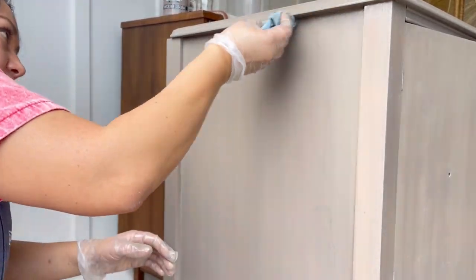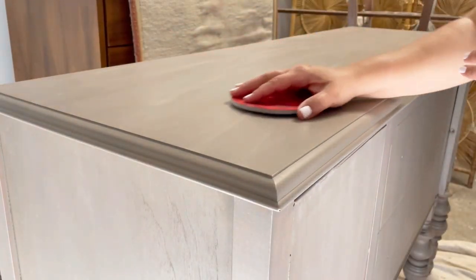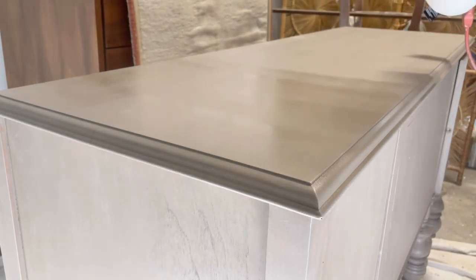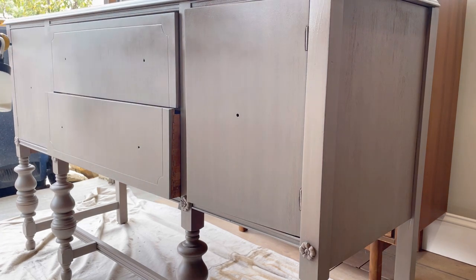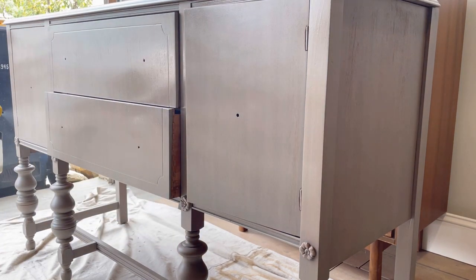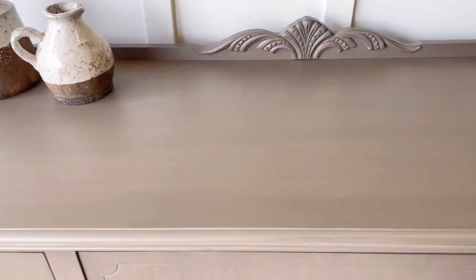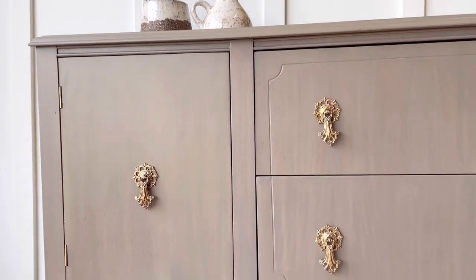It's possible that after applying the stain — even if it's oil-based — some wood fibers might raise, leaving some texture. If so, sand with an extra-fine grit and wipe it clean before top coating. To protect today's piece, I'm using high performance top coat from General Finishes — I apply a total of three coats. Let's take a quick look at where the buffet started, and this is today. I hope you guys like it, and I hope that if Leroy was here he would be pleased with what I did with this piece too. I will see you next time — let me know what you guys think of today's transformation in the comments.